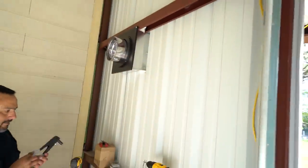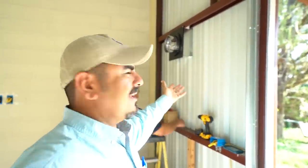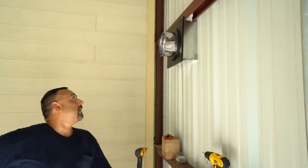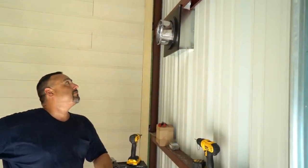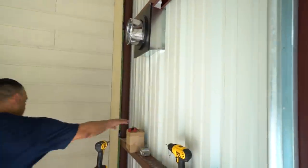After Leroy's done doing it, then I've got to fix it — I'm joking. Leroy will get it right. Six days later, it looks pretty good. Nice and clean. Now why couldn't the fireplace guy do that? So Leroy, what did you put around it? Just some flashing — some 25 gauge aluminum flashing. Then just pop rivet it and screw it up to the top there to the perimeter. And now the foam guys, they get the foam up to it and all is good.